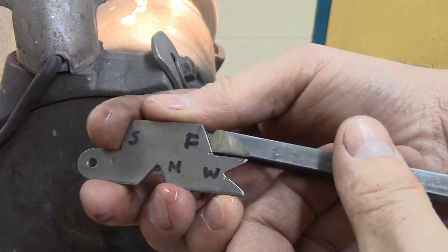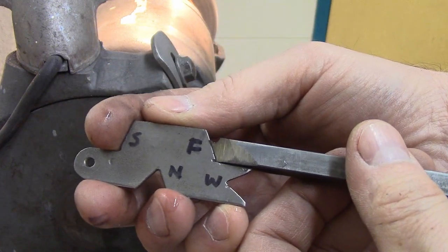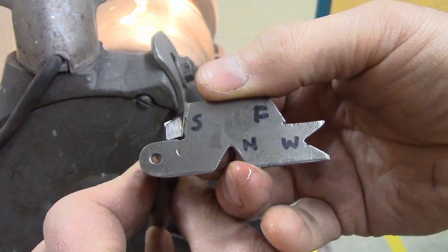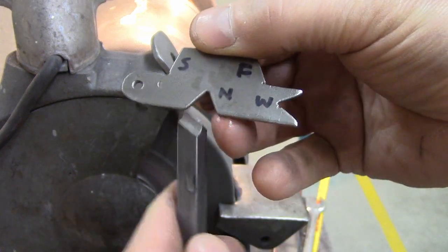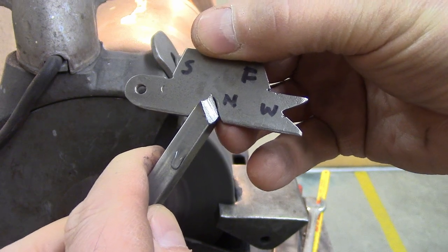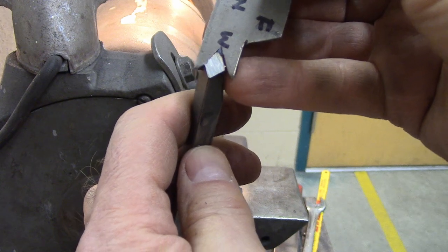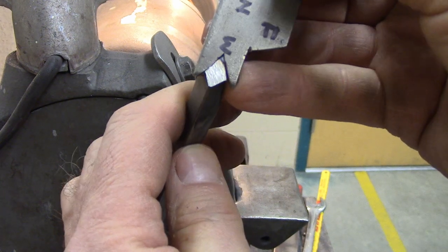In three grinding actions, you're going to grind a face angle, you're going to grind a side angle, and while you're doing each of those, you're trying to do half of your nose angle. And then the last part is the wedge angle. They're different for different materials — this is the one we're doing today.